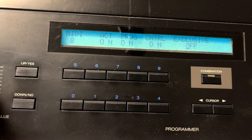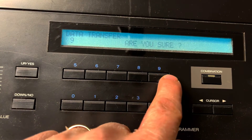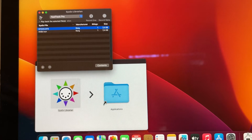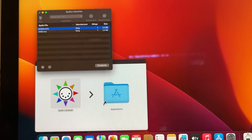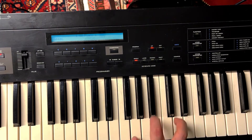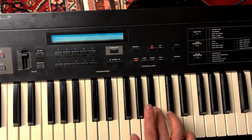And then you're finally going to have to press 4 to make the internal memory non-write protected. Once you've done that, you can go to your computer and get a SysEx librarian, download that file I was talking about. Just type in DS8 stock files. Then you can execute the sound, and you just basically play the SysEx file. And you now have sounds that sound like a keyboard again.